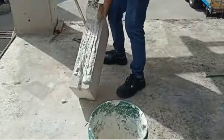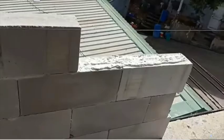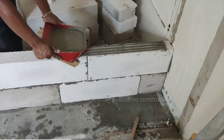And in my opinion, this video with the trowel that sits on top and then you just drag it along is the proper method of applying AAC. Now, I've seen all sorts of different ways to make these trays. I made one myself. But the funkiest one that I saw was just using a simple paint tray and cutting some notches in there and filling up the paint tray and then dragging it along. Cool, worked really well. Now the whole bottom isn't open like the one in the video here, nor was mine, and in retrospect, I probably should have done that. But mine went on pretty good, not dissatisfied with it at all, and worked out just fine.